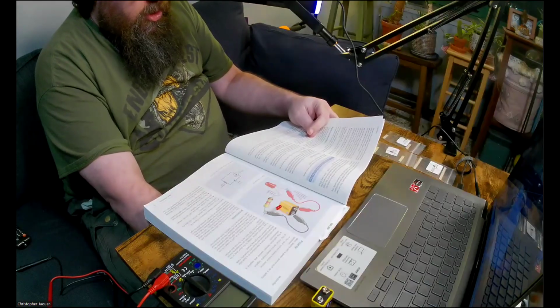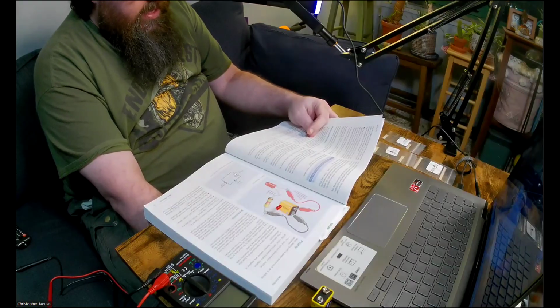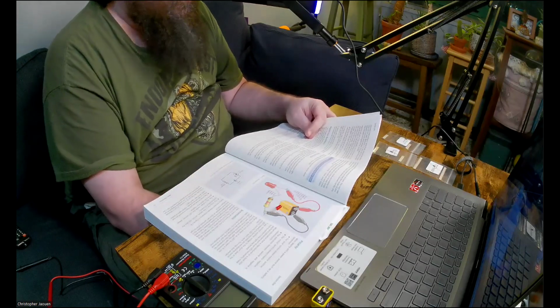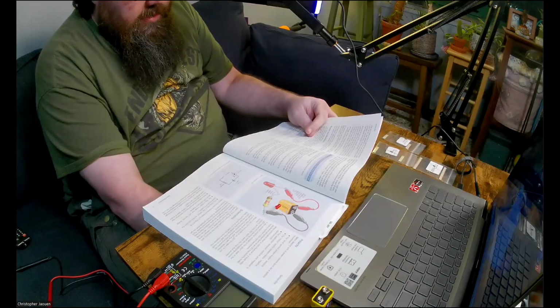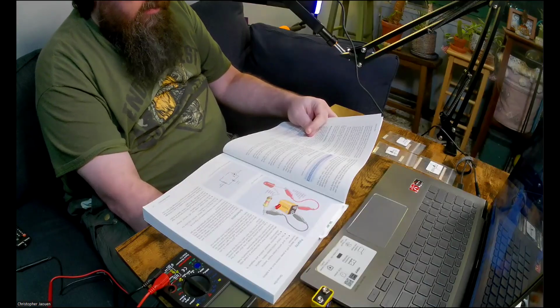When you pass electric current through an LED, its longer lead must always be more positive than its shorter lead, as if the long lead had some extra length added to it. So that's, I guess, a way of remembering which side goes to the positive. Touch the loose leads of the LED and the resistor together. Your LED lights up. Amazing. You have your first circuit.